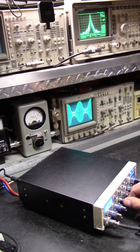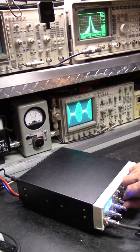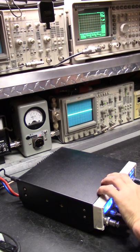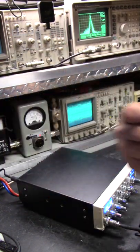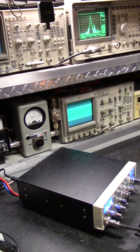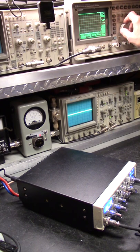Now let's increase power. Now let's decrease power. Notice the nonlinearity, right? Now at 6, 7, 8, 9, 10, right up against the 6. Notice the S's aren't even there. Flat as a pancake. But she's splattering real bad. 1, 2, 3, 4, 5, 6. I've seen a lot worse, but here, this is where it gets more interesting.